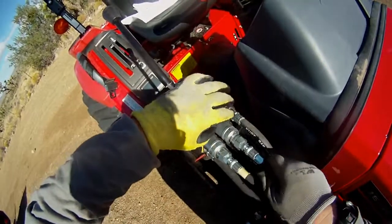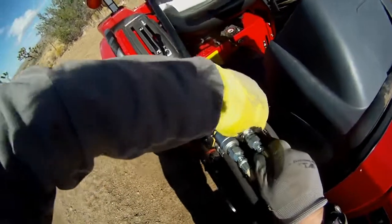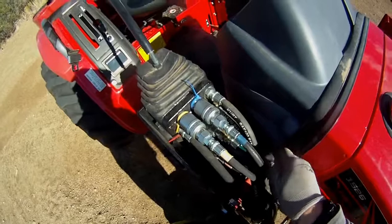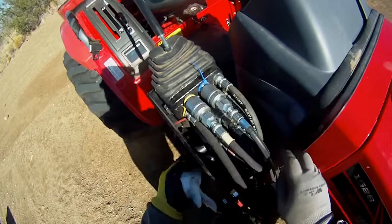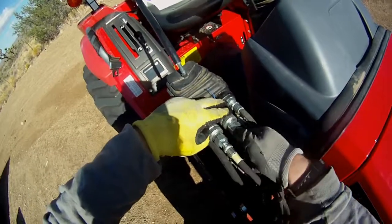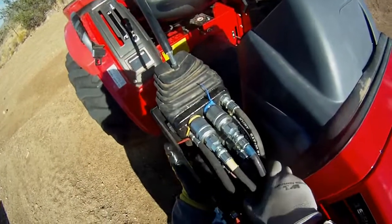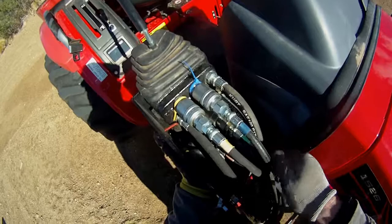Right. I guess that's okay. When I twisted it, the coupling was moving with it. That's usually not ideal. That one kind of moves too. But before, when I would do that, I wasn't able to hold the coupling back by hand. They would move together no matter how hard I tried. Well, you can't really get in there, so it's kind of hard to hold it back. But this one should be good. But that's a way you can test.